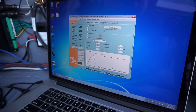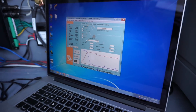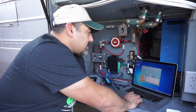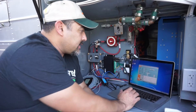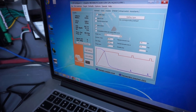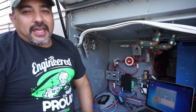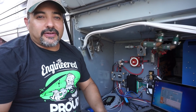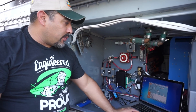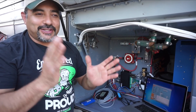We set up the charge parameters. In here you can select the battery type and charge curve. Charge curves are mostly used for lead acid batteries. For us the charge curve is fixed. We've got our absorption voltage set at 57.4 volts, which is 4.1 volts per cell. We've got our float voltage at 54 volts — float isn't really a thing for lithium, it just needs to be low enough not to interfere, so we set it close to nominal voltage. Our charge current is set at 52 amps — we can go up to 70, but we're trying to be nice to our batteries.